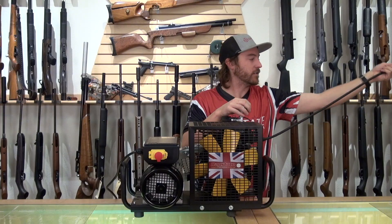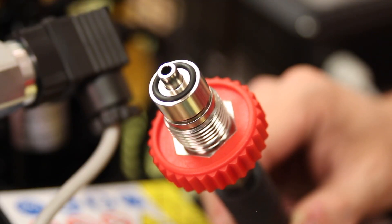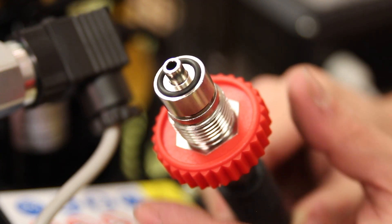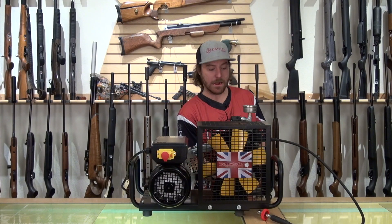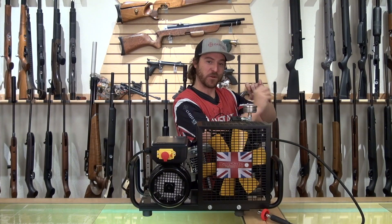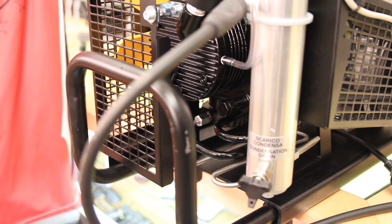The fill line is just over three feet and comes with a standard DIN 300 fitting — a very standard fitting in the world of scuba tanks and dive shops. The water separator has a down stem that sticks up so that if there is moisture, it falls to the bottom before you expel it, and the down stem sucks air away from the very bottom so there's no way to pull moisture through.